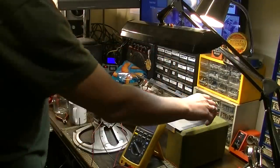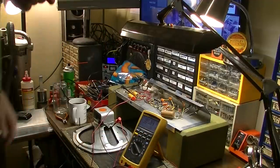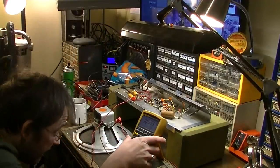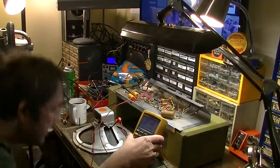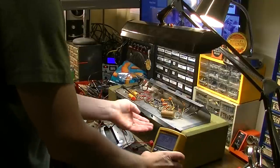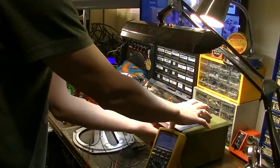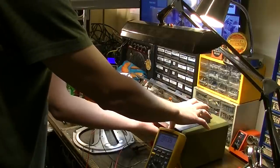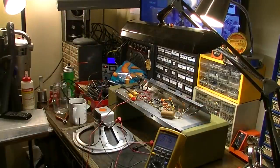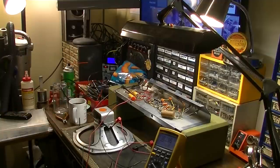And just as he stated, no tremolo yet. And if it is indeed a 6EU7, they do have a... There we go. Just like I said, pins weren't getting good contact on the 6EU7, now it works.